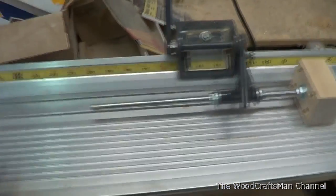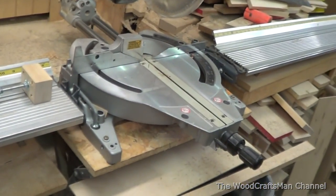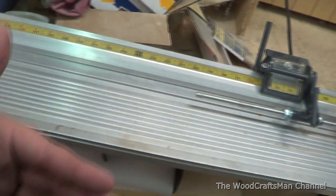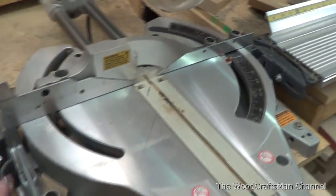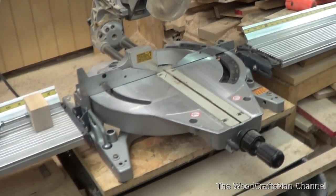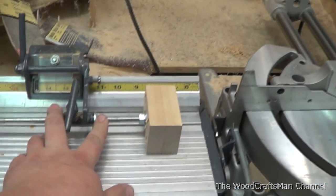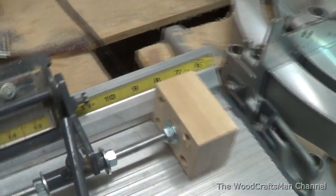And the nice thing about it is that the way I'm going to be doing mine, I can parallel the fences to each other and parallel the saw within the fence, and I'll be doing that with some aluminum extrusions so I can actually move the fence in and out, twist it side to side, and so forth. And then as far as leveling the saw, that's a totally different concept. Very identical to using cabinet levelers, but it's a much simpler idea. So basically I'm just going to be using bolts or ready rod in a similar pattern as this to level the saw.